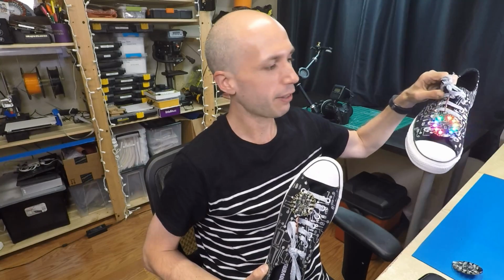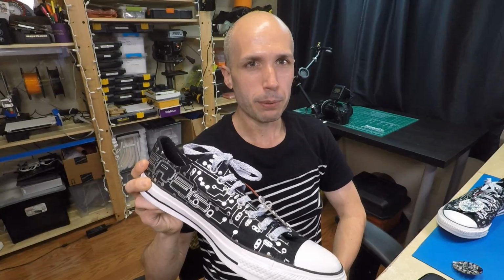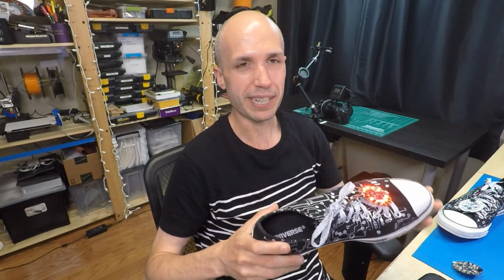The rainbow one is actually using a different algorithm that uses this adaptive step detection, whereas the red one, what we did in the first video, uses a simple threshold detection. So this red one needs a little bit of tweaking, like what we did in the first video. If you take a very soft step, notice I can move this thing around, and if I just very slightly move it as if I was taking a very light step, it's not detecting that. You have to take a strong step in order for it to detect the motion. It's not a very smart algorithm in the sense that you have to tell it ahead of time what your steps are like. That's not bad. You can tweak and tune that value, and it makes the code a little bit simpler, and it doesn't have to have a lot of this logic.